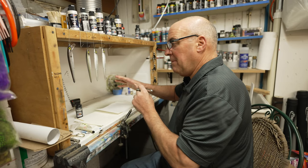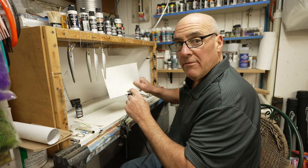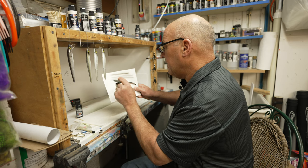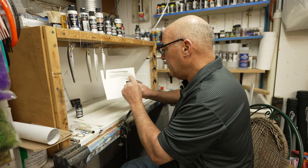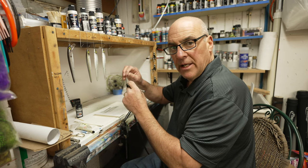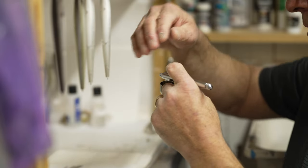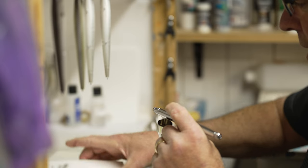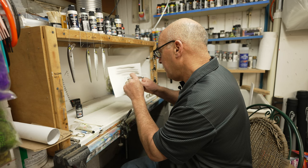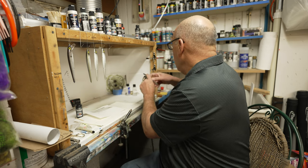So now what I want to do — I never spray on the bait without making a test first. So the first thing I want to do is I want to see how the paint's coming out of my gun. Perfect. Now you notice that when I made my line, I kept the air coming out of the gun when I stopped my stroke. That just helps out with tip dry or getting splatter on the bait. You never want to spray the bait without doing a test first. So now I'm going to control my air and my paint flow and let's try a dot. So we can make dots — we're good.